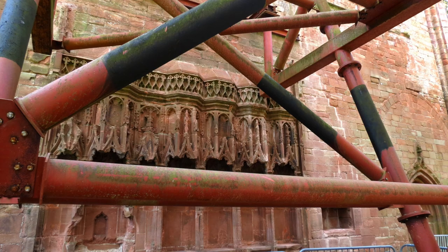We drill a meter in on both sides, put a pipe in it, and then we gravity feed grout into it. We can be filling on that side and nothing will be happening, and then after about two or three bucketfuls of grout, it'll be coming out over here. Even if you're filling up on this side and you think it's all full, next it could be coming out over there, because it'll find a void somewhere else.